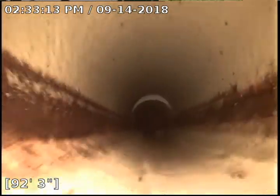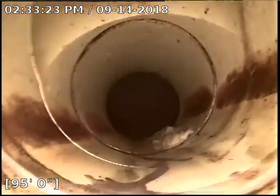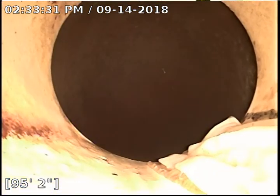So based on as long as the sewer is, and what I've seen coming in here, my belief is that the sewer is going to exit the property on the back left-hand corner of the property. So here's our clean out. And I'm going to want to go locate where that is. I believe that's going to be the entire sewer under the house, which everything looks really good.